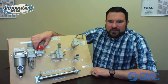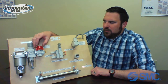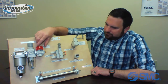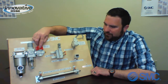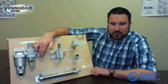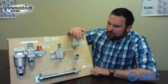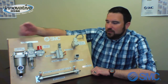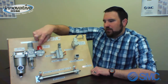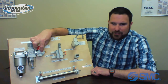Coming out of that, we then have what's called a VHS. This is very nice because it allows us to be compliant with OSHA regulations on power lockout and power isolation. OSHA rules say that all sources of power must be locked out — pneumatics and air being one of those types of power. You can see right here it actually says 'supply' right there in yellow, and the air is coming through it. When you turn it, it actually dumps the air back through the exhaust. You can put a silencer here, or order them with silencers built in, so it isn't a loud exhaust noise. When you put it on exhaust, it dumps the air pressure through and blocks air pressure coming this way. The supply is cut off and the air in your machine and system gets dumped back through it. It also has lockout points on both sides, so you can come through and actually lock out and tag out the air, just like you have to with power. This means you are now actually isolating your machine for safety.